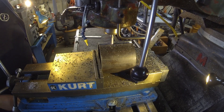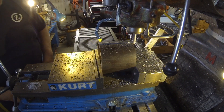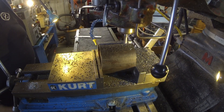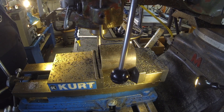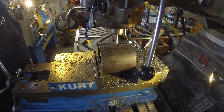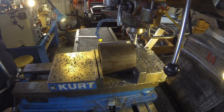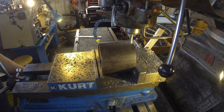It's 3 inches long and it's a 4-inch DOM tube with a 3.5-inch ID, which is the ID of the quill on the mill. This material was fairly hard but worked out pretty good.